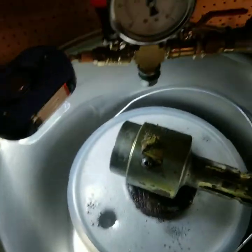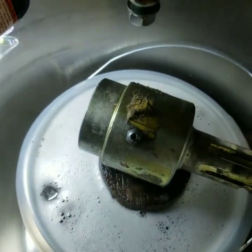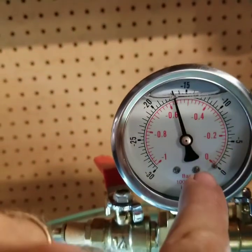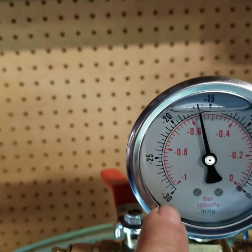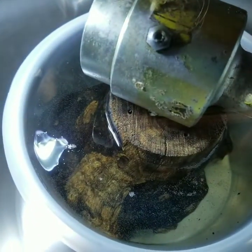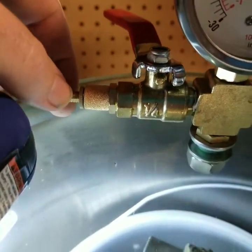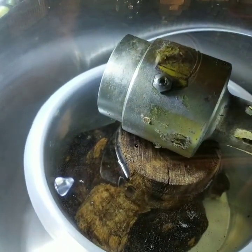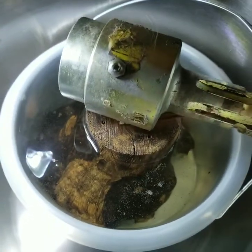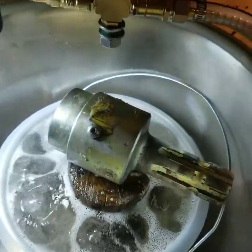I'll probably be doing this for a little bit. Eventually I'll draw this off, let it draw a complete vacuum, and hold it there until it quits bubbling — probably a couple of hours. We're down to about a half vacuum. Zero is one atmosphere, and this is one atmosphere of vacuum — zero air in the chamber. You can see we're a little over half and the bubbling has really slowed down quite a bit.